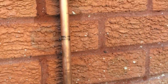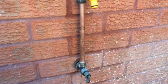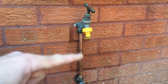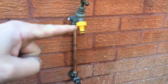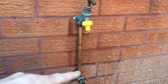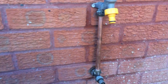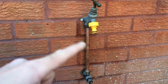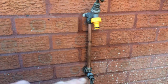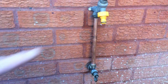That's fine. So all I've done there is replace this pipe as I showed you. Obviously I need to put a new bit of insulation on here - I don't have any with me so I'll take some tomorrow. It's basically just a foam insulation that you put around pipes, a couple of tie wraps and that'll do it. It just helps insulate it. But to be honest, in the winter time I never advise having water in the pipe anyway - always isolate it like I showed you under the sink, and then you've got a drain cock here to drain the pipe.